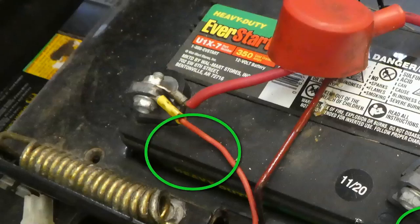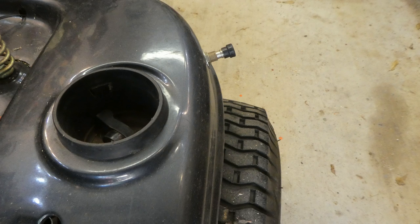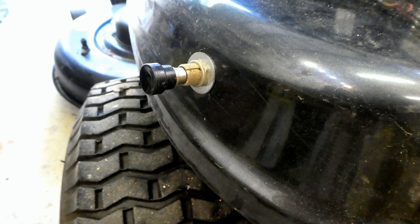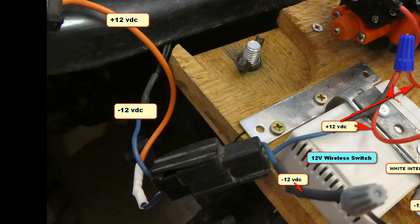With respect to wiring using the mower's battery, this shows how I added positive and negative wires onto the battery posts and ran the positive wire over to a push-on-push-off button mounted on the left fender where I could reach back to actuate the button. Here are the two wires, positive and negative, as they come out under the fender and into a plug for connecting to the pump assembly.